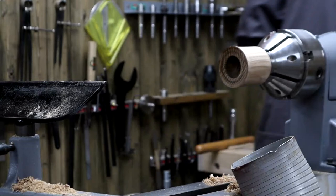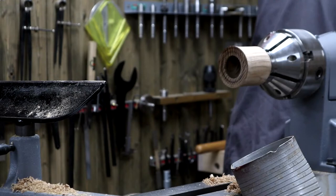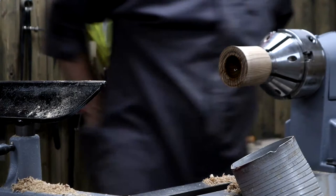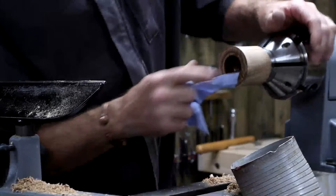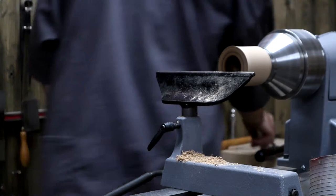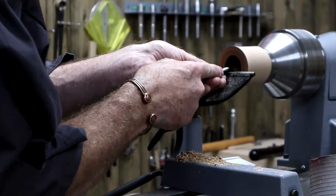Fingers checking what's happening in there - feels pretty good. We've sanded there, got to do a bit more in a minute. I'm just reaching for the cellulose sealer - I can seal inside what I've just sanded. Put the lid back on, just going to put it back out the way. A bit of blue paper towel to wipe off that excess sealer.